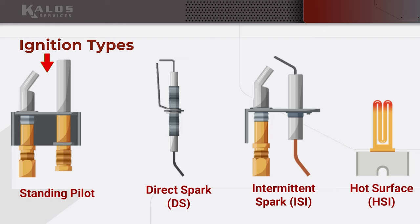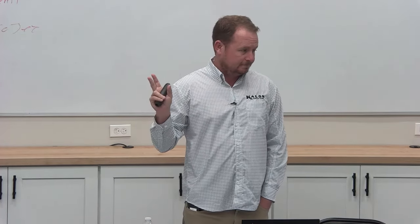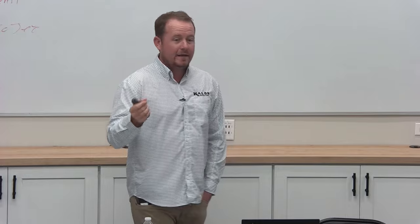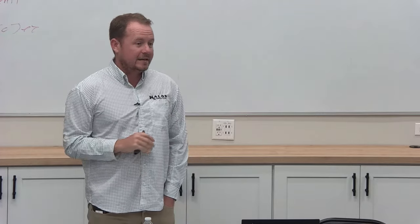So, first off, standing pilot. If you've ever had a client say something along the lines of, I think you need to light the pilot for the furnace or the boiler, that's because throughout most of the history of gas furnaces, water heaters, and gas fireplaces, they had something called standing pilot. In standing pilot, you have this tiny flame that would be on all the time. To save gas in the summer, they would often shut the gas supply off altogether. Then when you turned it back on, you would have to relight the pilot, and that pilot would stay on the entire heating season again.